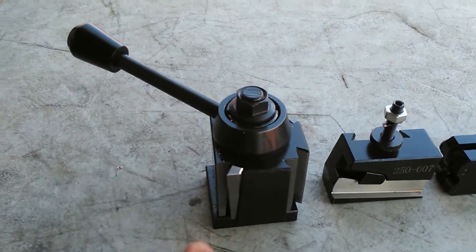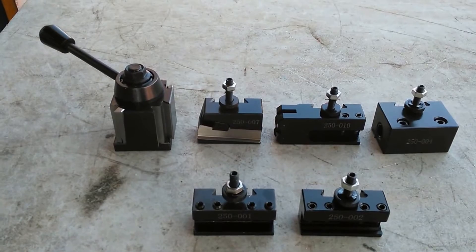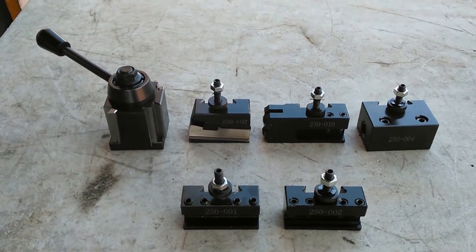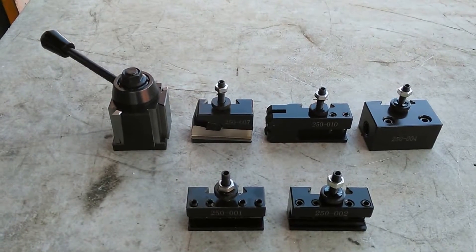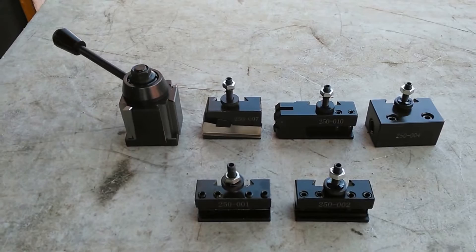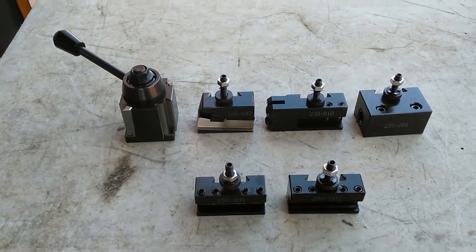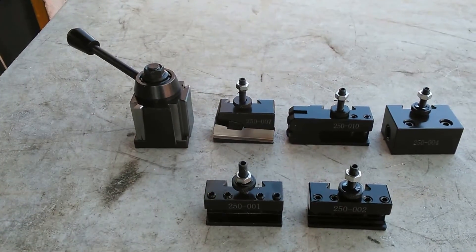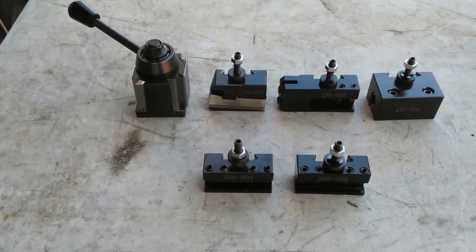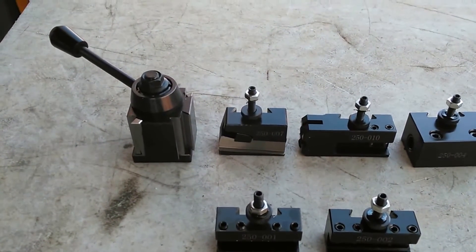I got this stuff from Mini Machine Shop. There are a couple of different brands of these tool posts available, but I trust Mini Machine Shop because they focus specifically on machinists — it's their main business, not a side item. Now, some tool posts are made out of aluminum for lightweight use, but I prefer cast iron. When you're cutting, there can be a certain harmonic that gets through the tool to the machine and cause vibration, so I'm proactive about stopping problems before they start. That's why I got the cast iron version instead.